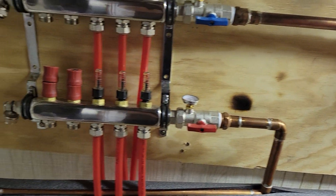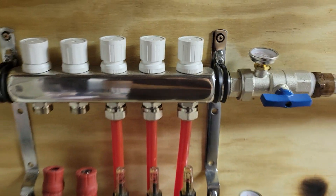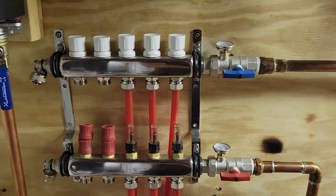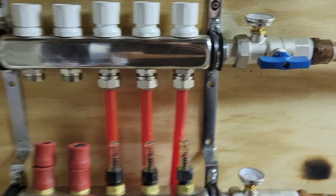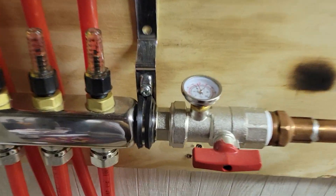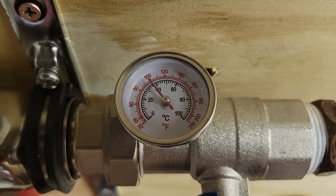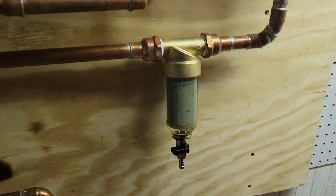It's pushing down through three sections, and this is the Bluefin manifold — you can see that Bluefin manifold here. I bought mostly everything you see here on supplyhouse.com, shout out to them. When you buy the Bluefin manifold you have to get these adapters as well. The hot water is coming out at about 110 degrees and coming back at just below 100. I regulate the gallons per minute and it's just open for all three sections.